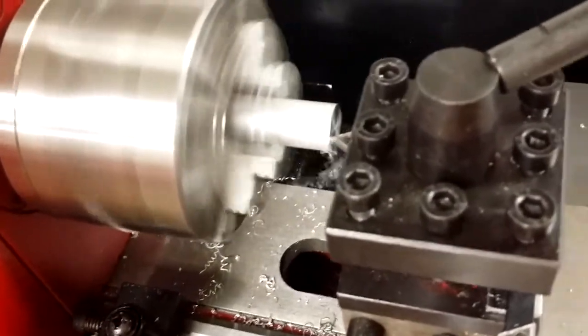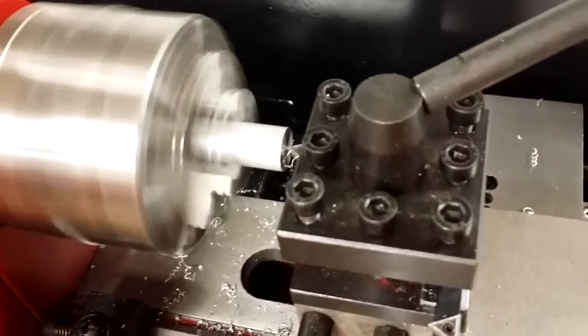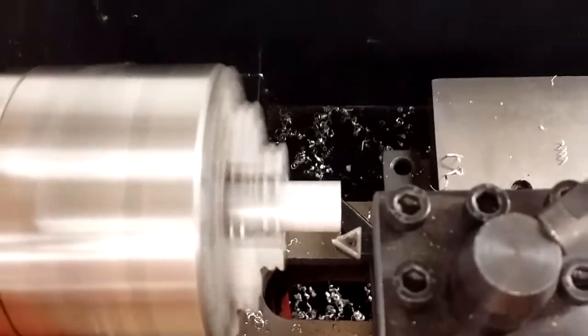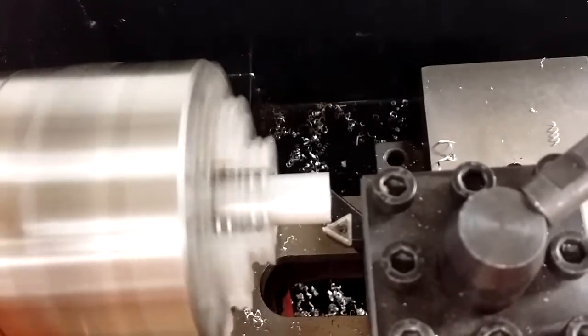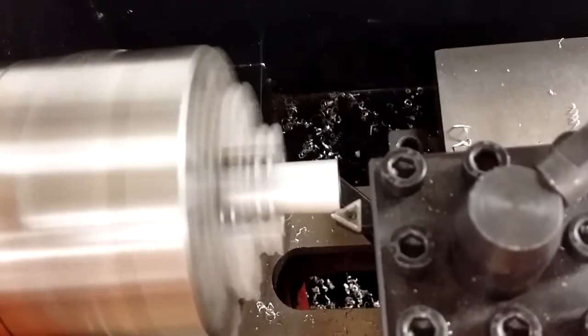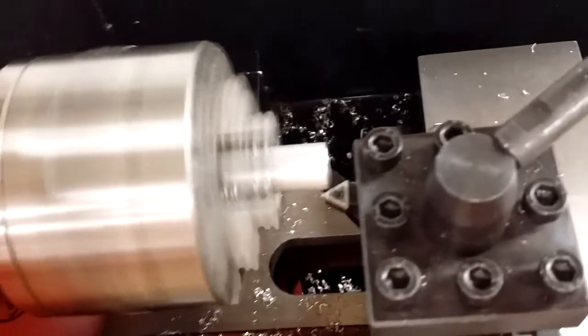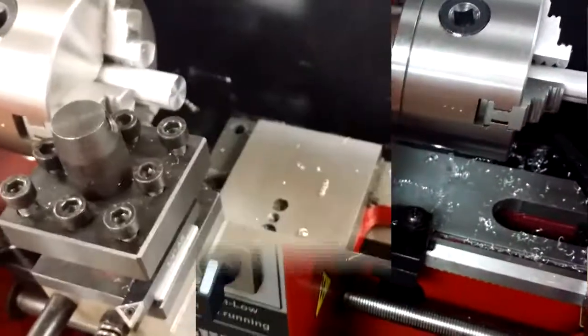When that's complete, one reason I like to use these triangular tool bits, the one that is equally faced in both directions, is that I will retract the cross slide and then advance the compound just a bit so that I'll be cutting on the edge of the tool, and advance back in. That makes it really easy to put a 45-degree chamfer on the workpiece, breaking that sharp edge. Important to always turn the speed control to 0 as well as turn off the power.